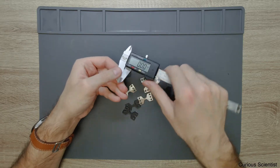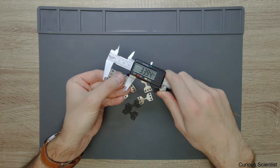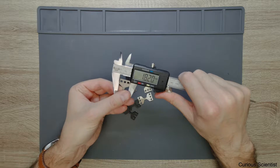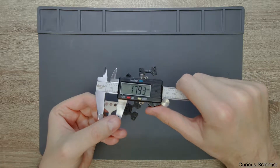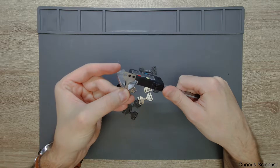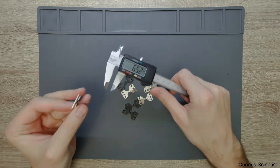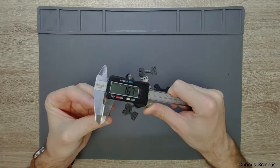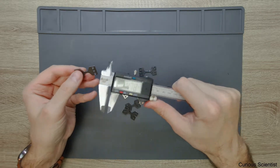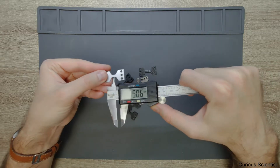So we just take this caliper. This is like 34 mm and then the width of the shoulder area is about 18 mm. And then we have this section in the middle — I tried to fit it perfectly. This is 3.6 mm and then the thickness — well, a micrometer screw would be better — but this is roughly 1 mm thick. And then the parallel length, well it should be roughly about 5 mm, so you can see that the parallel length is about 5 mm.